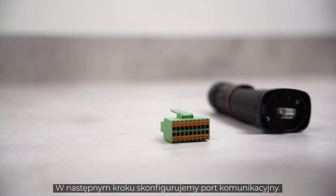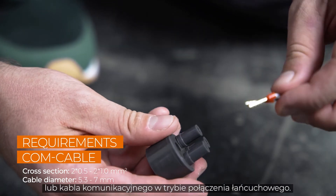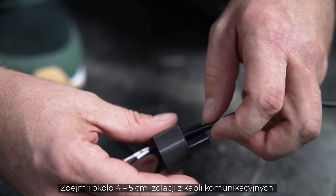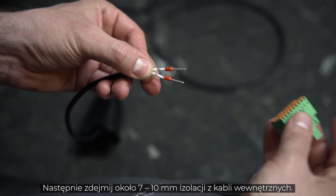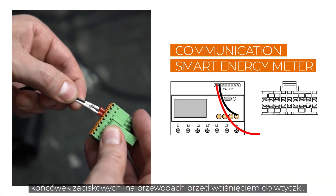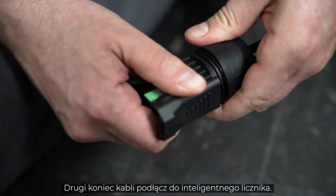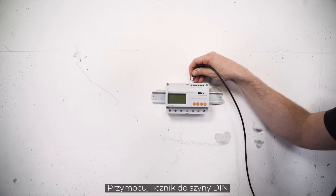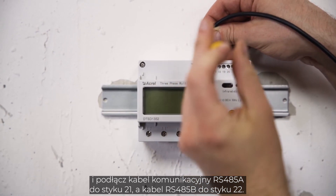In the next step, we will set up the communication port. Via this port, you can connect the smart energy meter or the communication cable for daisy chain mode. Let's start with the energy meter, which is needed for the feed-in power function. Remove approximately 4–5 cm of the cable sheath of the communication cables, then strip approximately 7–10 mm off the inner cables. If necessary, fit the cables with end sleeves before pushing them into the plug. The smart meter is connected to ports A2 and B2. The other end of the cable needs to be connected to the smart meter itself.